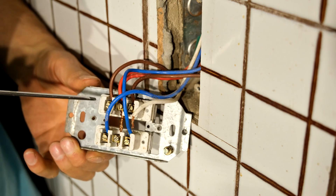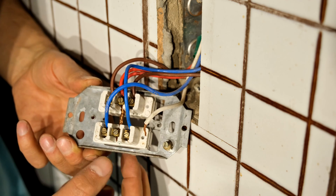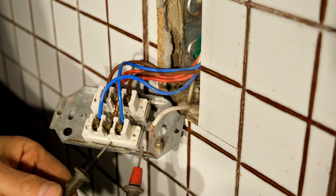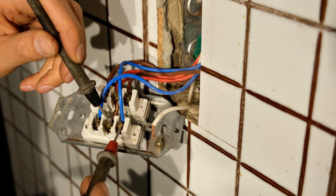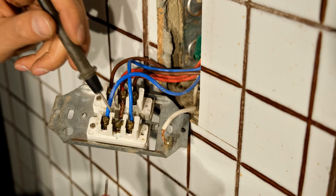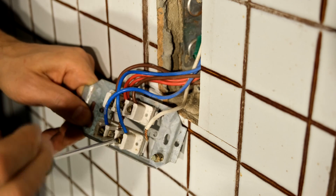Let's recap: this is one kitchen light, this is the other kitchen light, and this is the pantry light. The pantry light needs to be doubled up to the kitchen light. I just have to determine which way I want the switch to be when the pantry light goes on. I put my multimeter on continuity - if it's a short it makes a sound. I determine the closed position and toggle the switch to confirm, so it must be at the bottom position.